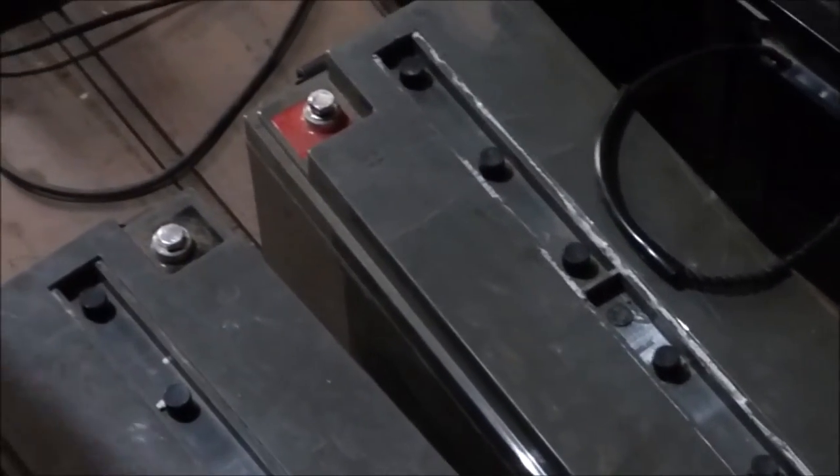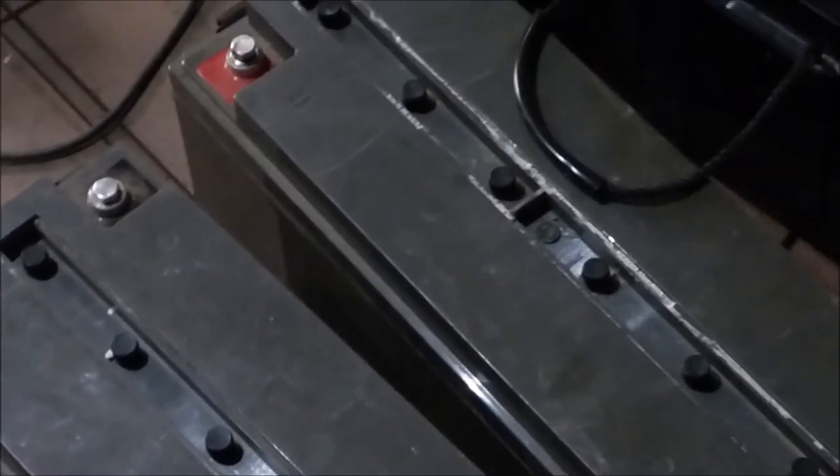How does sulfation occur? In Nigeria, it's mostly from over-discharging your batteries. Customers discharge their batteries at 10.5 or 11 volts, which doesn't even register on the chart. At 11.5 volts, your battery is at 10 percent — you only have 10 percent left. So at 10.5 volts, there's really nothing. You've drawn the battery way below anything that is on the charts, and that's what causes sulfation. What is sulfation? It looks like the white substance you see on the battery plate — think of it as plaque in your arteries that prevents the flow of blood. This prevents the flow of energy between the positive and negative plates.